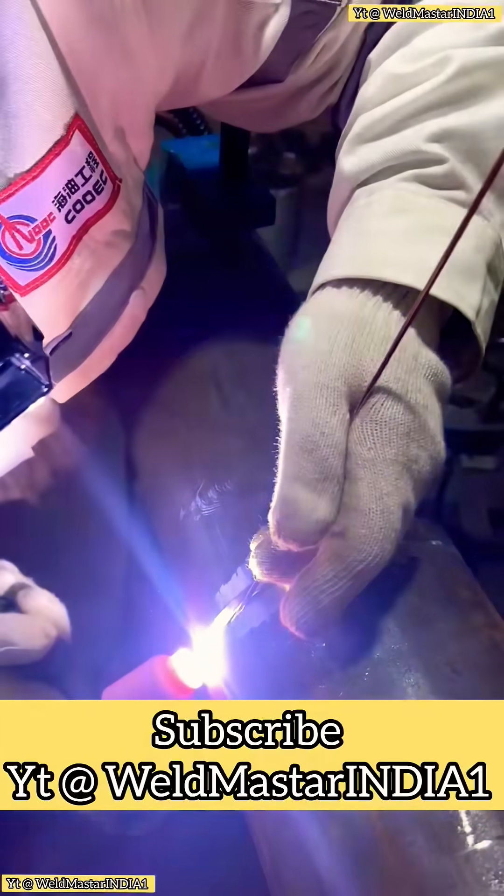Warning — pay attention. Keep the tungsten short and low to control the shape of the molten pool. For the internal bead root pass shape, maintain a weld pool width of about one to two millimeters for the best result.